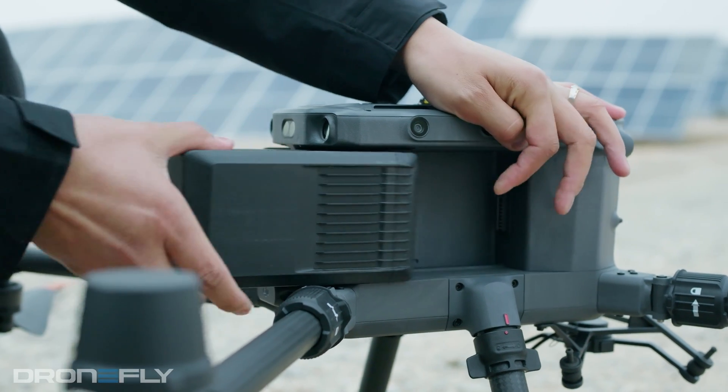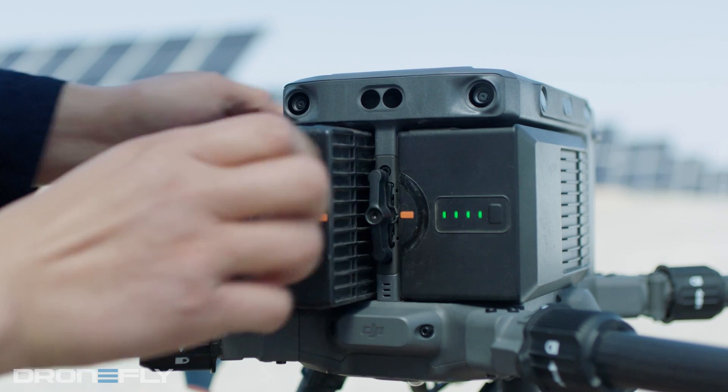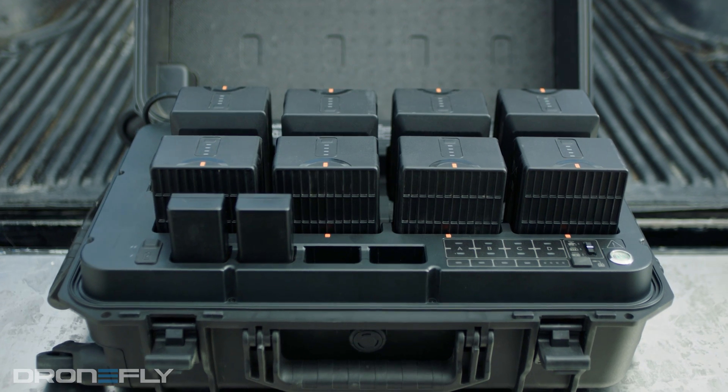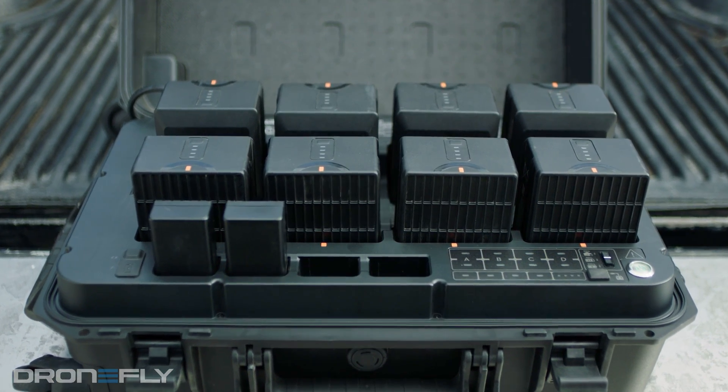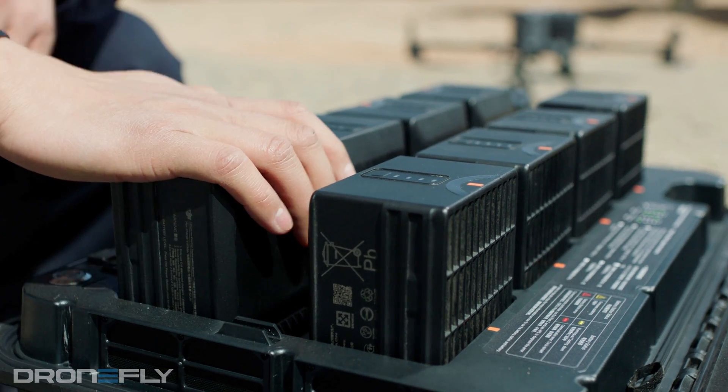Two: the new battery system. The new TB65 batteries offer a lifespan of 400 power cycles, which doubles that of the outgoing TB60 batteries, decreasing battery maintenance and the cost per flight. To help you with this is the new battery charging station, which has added a new switch to power your batteries to 100%, 90% for fastest charge, or 50% for storage. This will help you get the most life out of your batteries and make sure you always have power when out in the field.